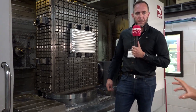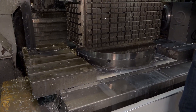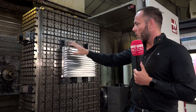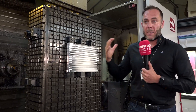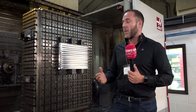The machine configuration is a little bit different having a horizontal single pallet, but it can also be used in different configurations. What it gives the customer is a fourth axis with this rotary table, but having micro lock on there gives him the flexibility to do so many different jobs all at once. You've got quite a large component in aluminium on this side, you can put a long component - it's full flexibility. When PCML purchased the machine they didn't really know what they were going to be making from day to day, so they needed a workholding system that gave them flexibility and versatility, and micro lock really is the only thing that can do that.